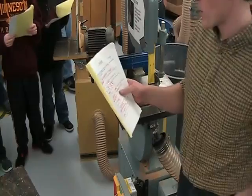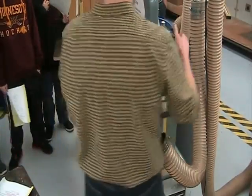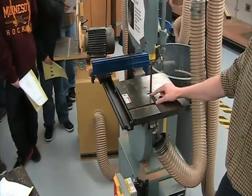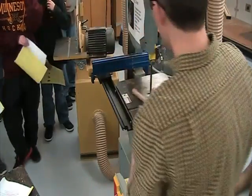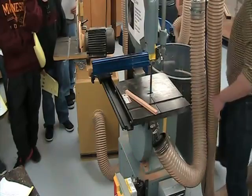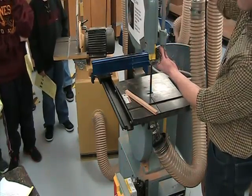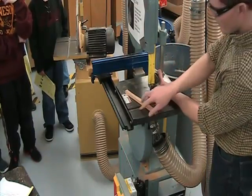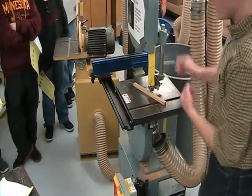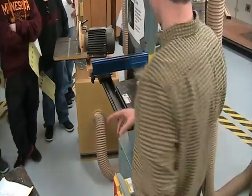Numbers three and four — this is probably where the most wrong answers happen, and these are some of the most important questions. There's a guard — this yellow thing — and guides that keep the blade in the right place. If you come up here and have all these teeth showing, you need to do something before making any cuts. Your hand can get major damage done to it. You need to loosen this black knob to lower the guard. Set it so your fingers do not fit in there with the board. Even if you slip, the guards will save you — set up the situation so that even if all goes wrong, you're still safe.